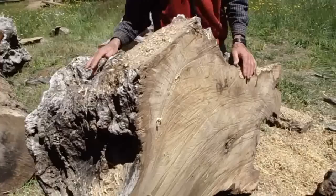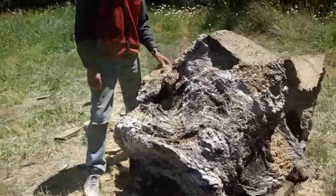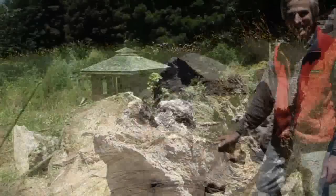What's the next stage? This will be the top of the table. These two pieces will bolt together. And then I have to figure out where the legs are going to come in when they bolt together, because I have this area that comes down here that'll help form the legs. So I'll have to remove wood and then shape the legs in relationship to how they bolt together. So both sides have that same thing I have to work out.